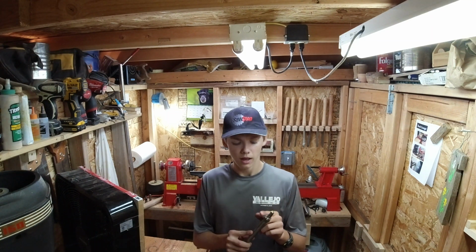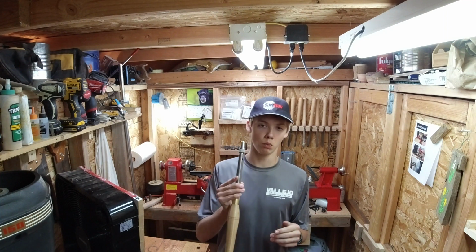And once you do, I think you'll be rewarded for your efforts because when doing shearing cuts for smoothing out the inside of the bowl and using it in the 90-degree form for refining the shape of the inside of the bowl after the bowl gouge work has been completed, it works really great. I like the Excelsior titanium nitride coated cutter because it has a nice edge retention and it works just fine for that. So overall, I like it for doing the inside of the bowls.